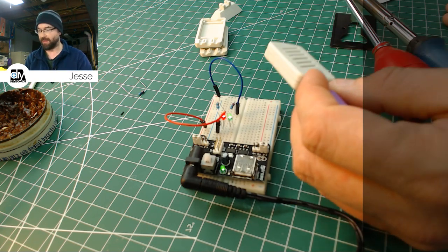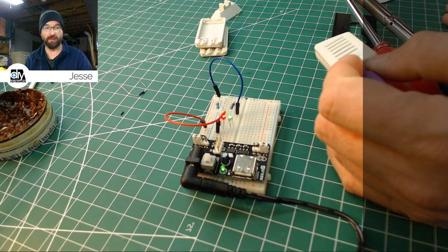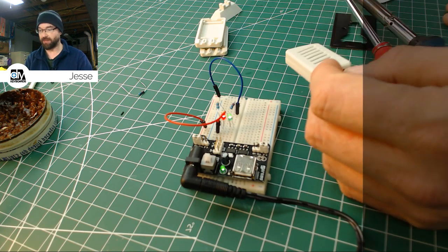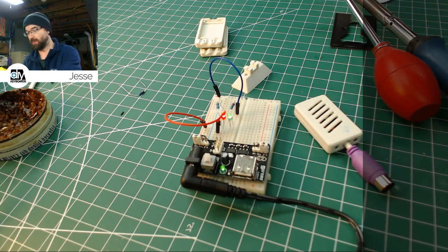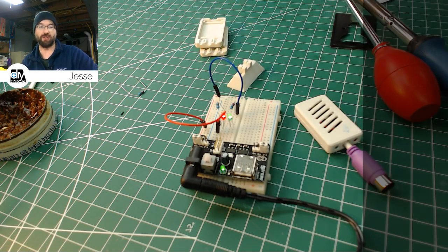Maybe I'll keep them, but we're going to start with these fresh ones off the breadboard here tonight. And we'll reassemble this in the new case. The other thing I had to show was I did make up a jig, and the jig will allow us to bend a nice even connection between the inside two leads on the LEDs, which are the negative leads, and we'll get a nice square bend on them. Then when they're in the case, I'll fold them down tight, and they'll be really nice and tight and organized in there, and everything will look sharp. So with that, let's get started.